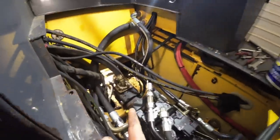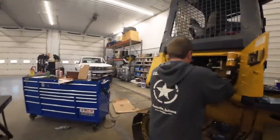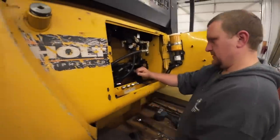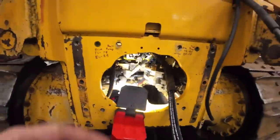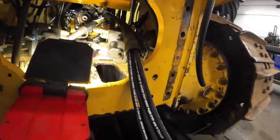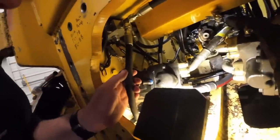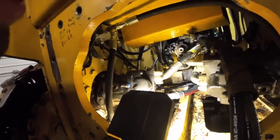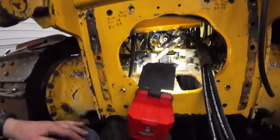All right, got the pump on there. I got the feed and the pressure line on there. I think the last set of hoses right here. We got four new test hoses. They got remote ports up here to test pressures on the drive motors going forward and reverse. I went ahead and threw four new lines on that. Kevin put new brake lines, brake hoses on here. So everything is 100% new as far as hose wise back here. So hopefully no problems with that.